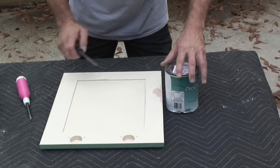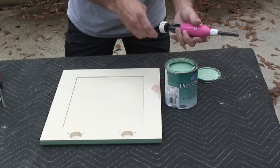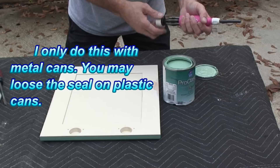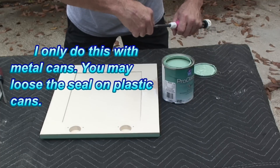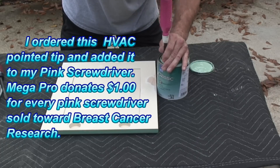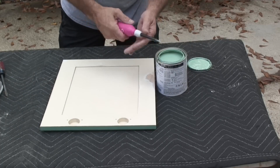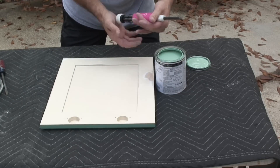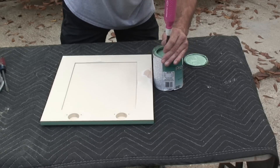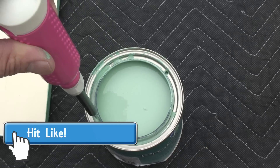Let me give you a quick tip. In this lip right here, you have a channel. What I do is I pop holes in there so when the paint gets in that lip and that rim, you can just push it around and it's going to fall down in the holes and not clog up and keep your paint lid from coming open the next time you use it. I'll take this and put this point right down in there and pop some holes in it. This particular screwdriver has an awl on it — a pointed tip that really makes it easy. It's an attachment that goes on Mega Pro screwdrivers. You see how the holes are in here — so when this drains, it's going to go down in that channel and not gum up.